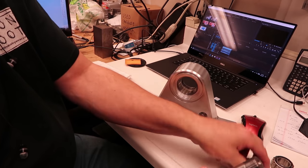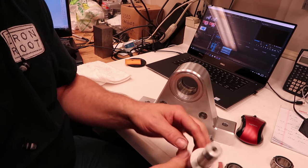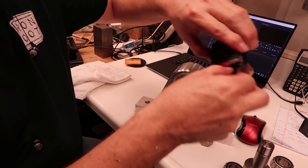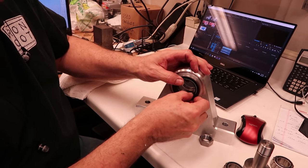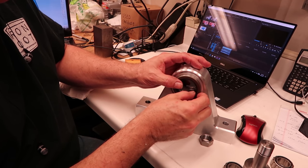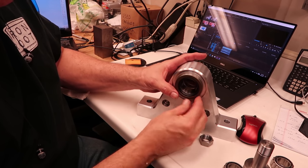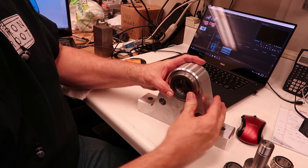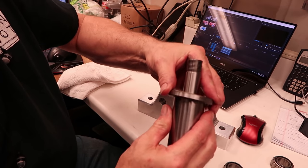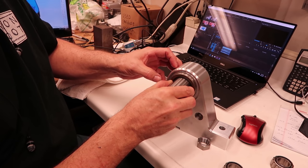The shaft has the roller. This is going to be shrink fit into the end of the fixture. And there's going to be an oil seal as well, pressed in here in this counterbore. Actually, it's going to go this way, and so that'll be pressed into that bore. I don't want to put that in right at the moment. So that fits over the end of the shaft here when it's in there, to seal off even more.